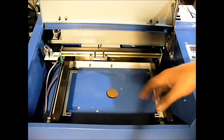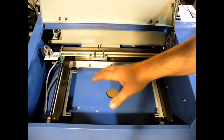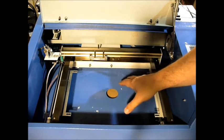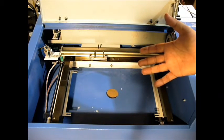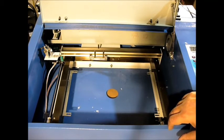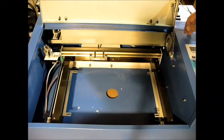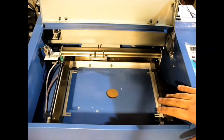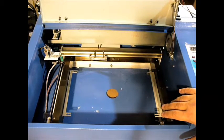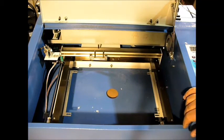One of the things I'm thinking about — and haven't decided yet — is that Light Objects for about $150 has a bare bones separate controlled Z-axis bed that will fit in here. The question is how do you control the Z-axis, so you'd need a separate Arduino setup, which I can do. I'm also thinking about converting the control board to GRBL. I'm documenting these processes for anybody that wants to follow, so when I make the new screen bed and change these brackets, I'll show that.